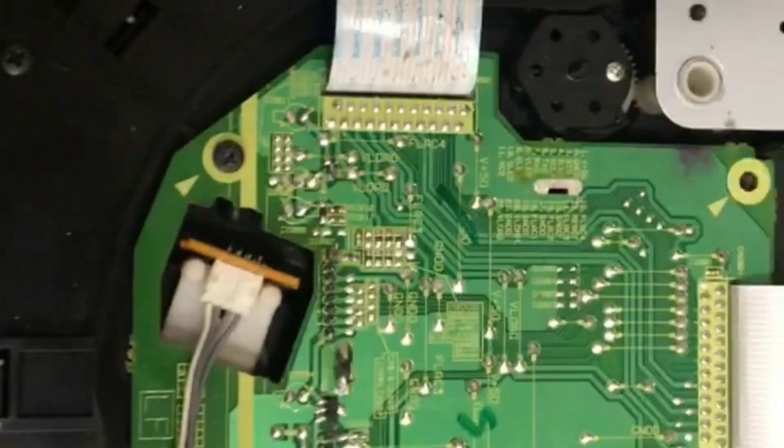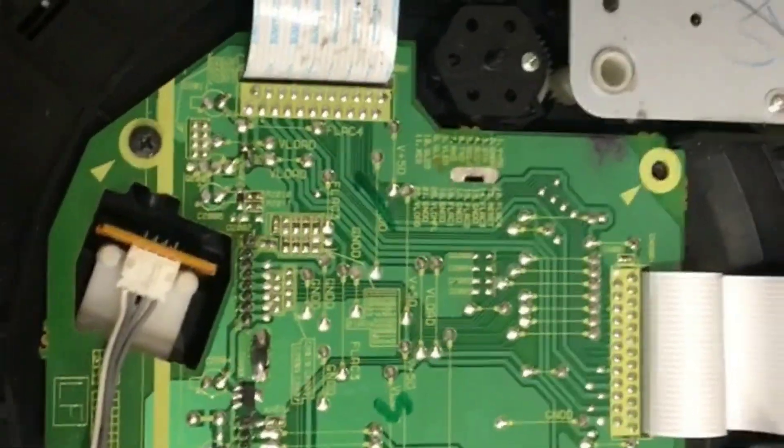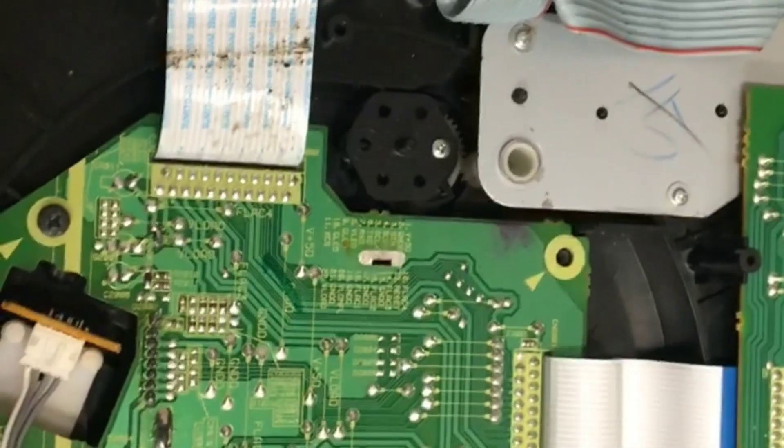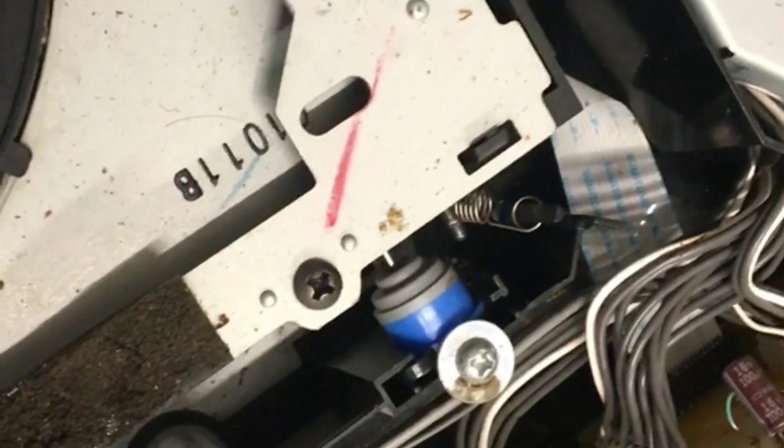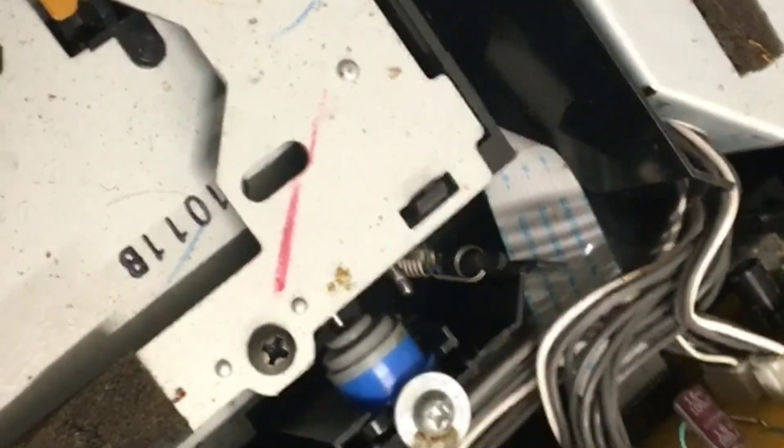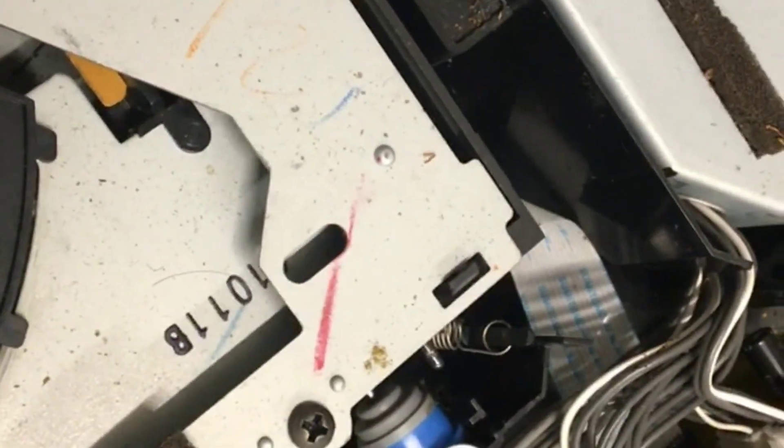I just thought I'd let you know that on this display — this is the centre display — if you get it where you've lent it out and it comes back not working, this row of connectors here have long legs that go to the fluorescent display. Any drop damage — if those legs just bend a couple of millimeters — it will short out the signal path. And there's a set of fuses here. You test them for continuity. If they've blown, re-straighten the legs on this centre display and replace the fuses. Normally one amp or 1.5 amp — they're made by littlefuse.com. I normally use any fuse of that rated amperage.